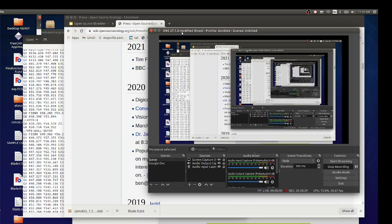What about pure lime? Different qualities of soil determine how much lime and cement you could use for best stabilization. Some people stabilize with plain lime, some stabilize with cement, and it depends on the clay versus sand content of your block. That's once again this material science stuff where the devil's in the details. Maybe for some blocks it'll actually work better with just plain lime, and it depends on up to what PSI and stuff like that.